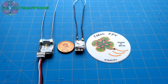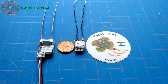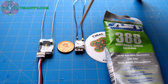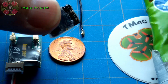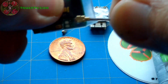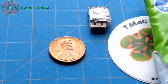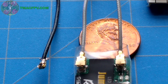Let's take a look at those. What I had to do on the RXSR to keep the antennas on with its very small UFL connector was use electronic grade silicone on the connectors to keep them on the board because they kept popping off. Here you can see how easily these things pop off from that very small UFL connector. Over here, although there is shrink wrap on it, I'm tugging on these and they're not pulling off. These have a bigger and apparently more durable connector, and a much more sturdy antenna cable than what you have with the RXSR.